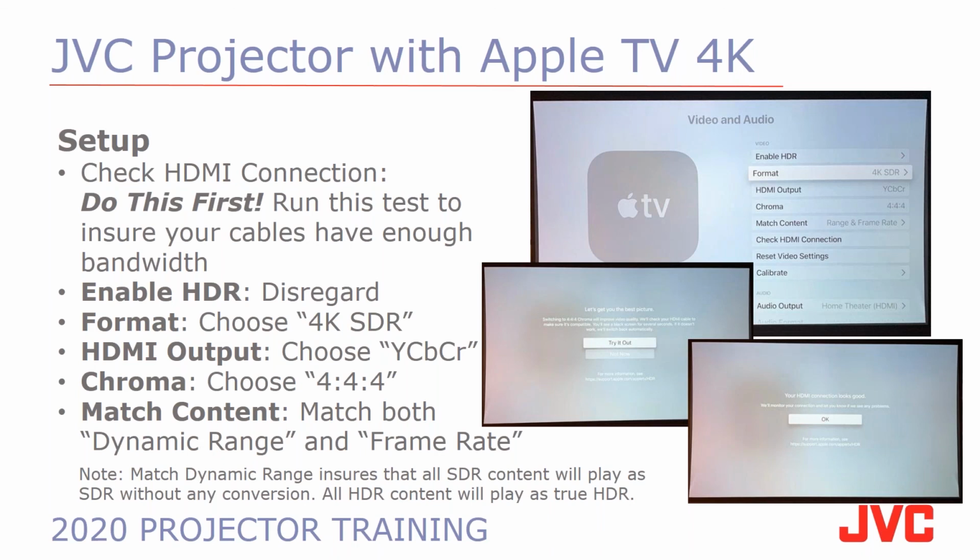I hope that answers the question, but it isn't specific to Roku or Fire or whatever. Okay. Yeah, and the concept of 24 frames versus 30 frames, some of us old schoolers remember that from working with Gordon at Faroudja, who JVC worked with as well. I remember the JVC dealer projector that had the Faroudja front end, and they talked about 3-2 pulldown for that exact reason: how to get it to match to be effectively displayed on video.